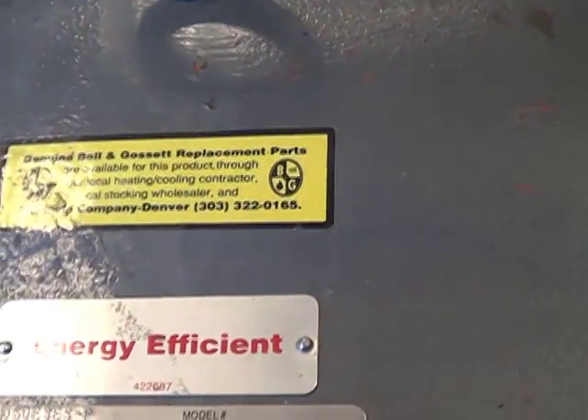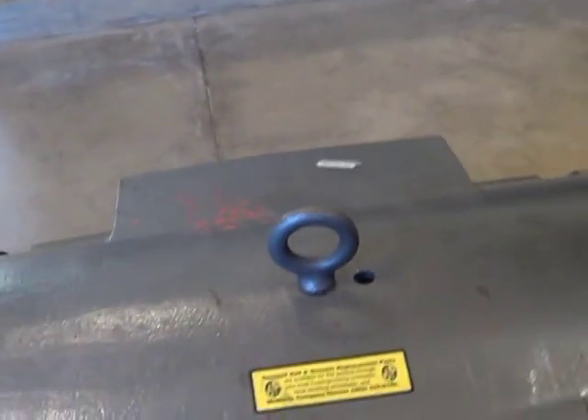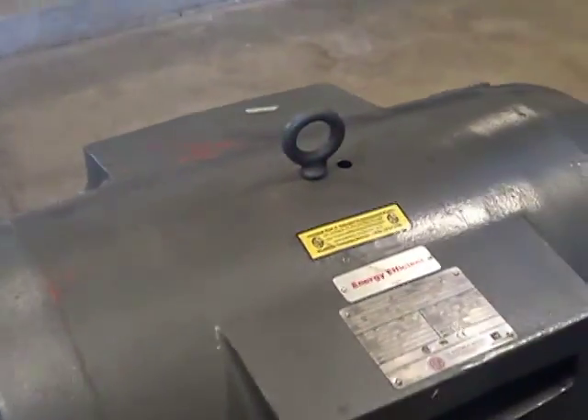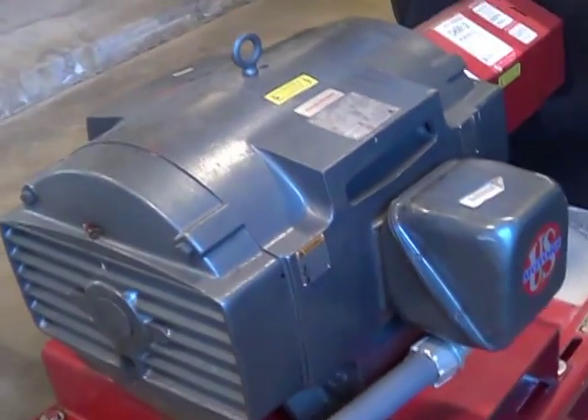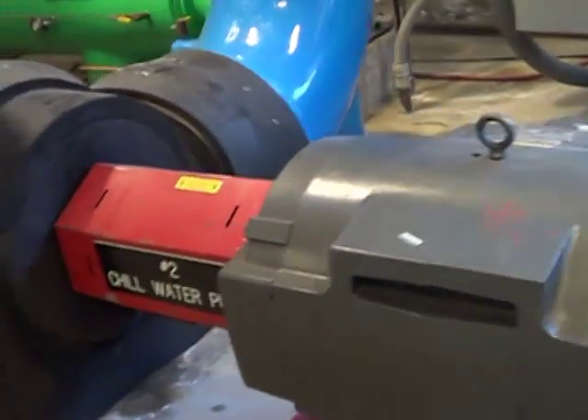She's running pretty good — amps, volts, 60 amps. Wow, we're doing really good. That's pulling 52 amps over there. This pump is functioning and we're below the motor tag rating — that's really good. Last time it was 63 amps on the old soft start.